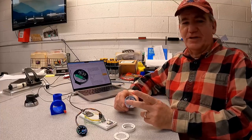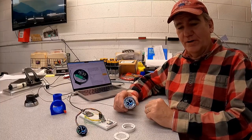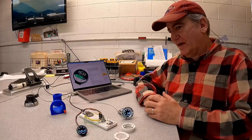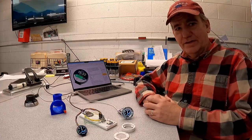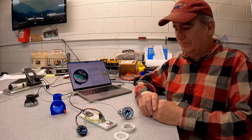And so it's just going to have a relay output. There's actually two relays on the little board. The second relay I'll wire into an alarm so we can have an audible alert that the vacuum pump has a leak so bad that it can't keep up, and potentially even wire that into the VF5 so that it would stop cutting if the vacuum isn't drawn down to a certain level.